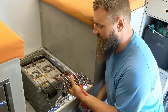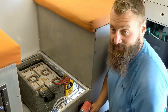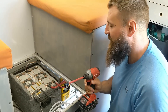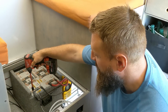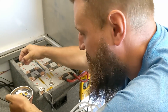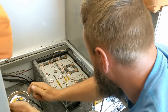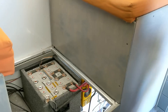When dealing with big batteries you certainly wouldn't want to be swinging around a wrench, which could short out to the next cell. So I'm using a socket and I've put some hockey tape over the shaft just to keep anything from touching. I'm taking off the bus bars as I go so there's no chance of something moving around and shorting — I don't want to loosen them all and leave them flopping around.